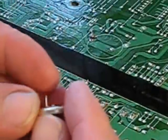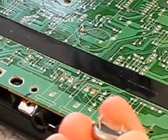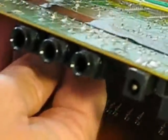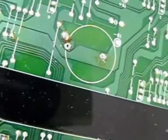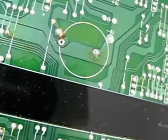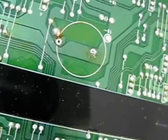We've got our new battery here, getting ready to put it in. You're going to have to slide it back into the two holes on the board the exact same way that it came out, and solder it in. I put the battery in from the underside of the circuit board — the two soldered leads are through the board. The battery will stay in by itself, so now all you have to do is re-solder those leads back into the board.